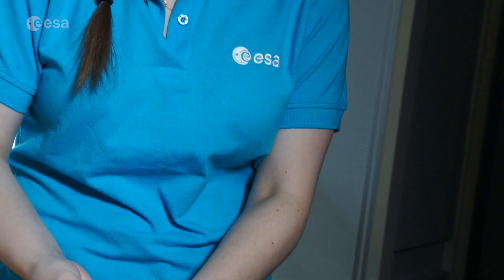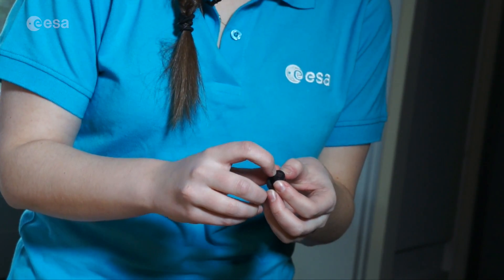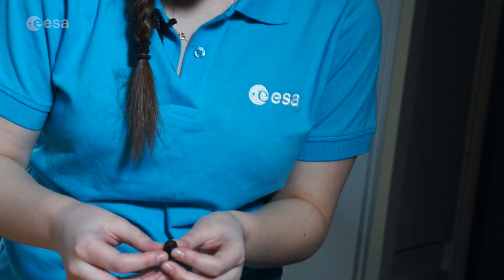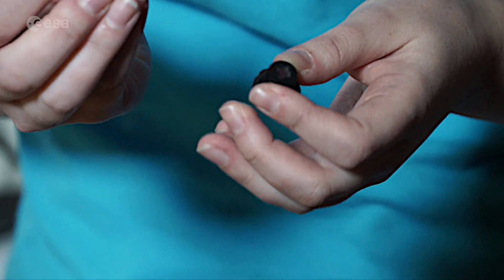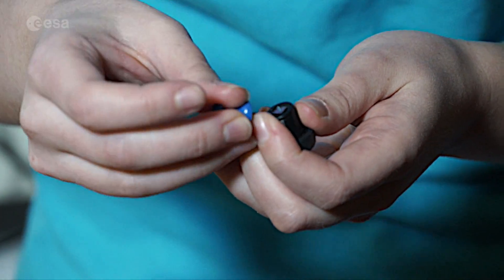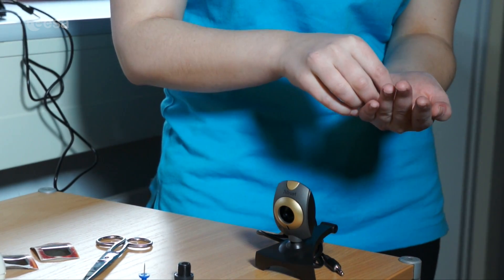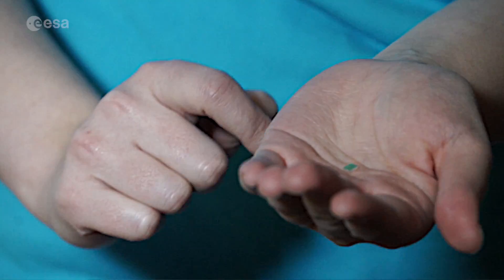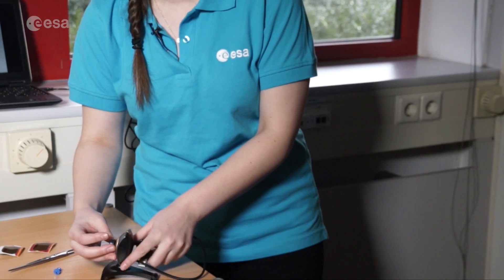The first step will be to completely unscrew the manual focusing ring. Inside, you're going to see a small piece of tinted glass. You'll notice that it has a reddish-green tint, and it's exactly what we need to remove in order to allow our camera to detect infrared radiation. The easiest way to do this is by taking something sharp like a small pin, gently inserting it into the side, and popping it up. Please be careful, as depending on how hard the filter is stuck inside, it can shatter when you pop it out. Now that we've removed the infrared filter, we can reattach the manual focusing ring back into the web camera.